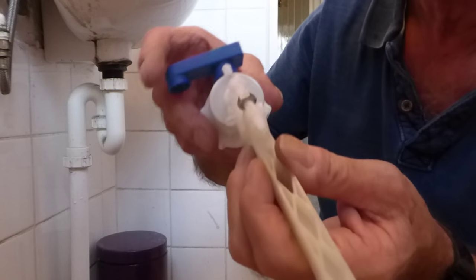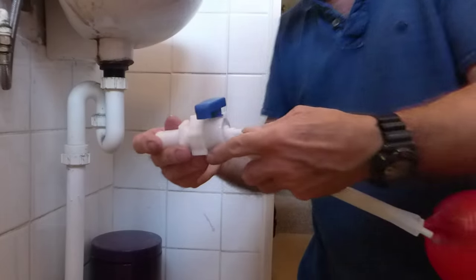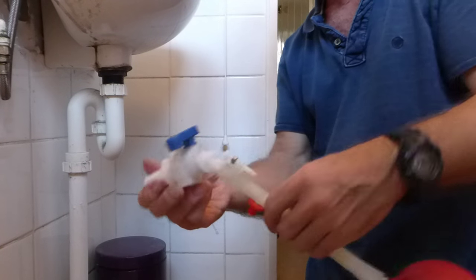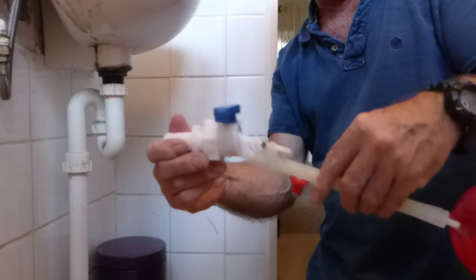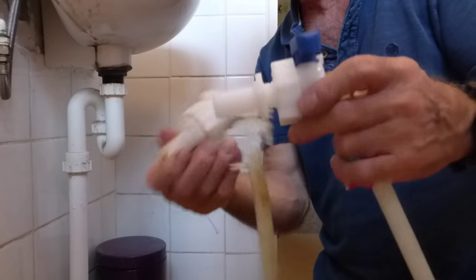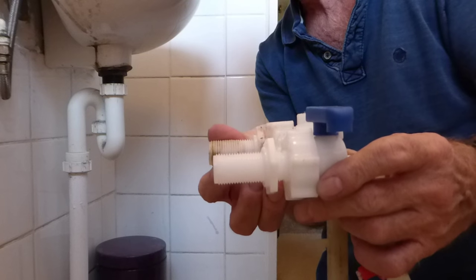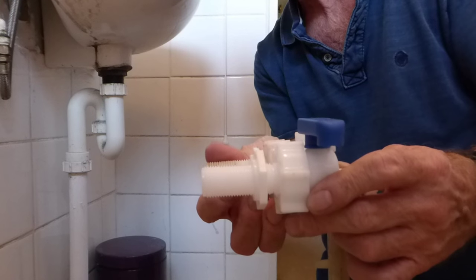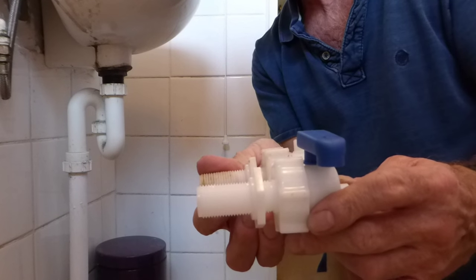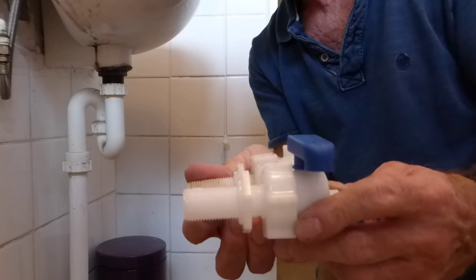Get some adjustments, get it roughly right before you fit it in. The valve is roughly ready now — I've screwed the ball on, got the top on, and adjusted it roughly where I think the level might be. One little tip: get the old valve and put it up against the new one so you can see how far to screw the back nut in, so it will be the right distance to do up on the pipe outside. Get it about the same distance so you know it will fit the connector — the tap swivel as we call it — on the pipework.